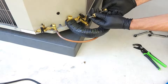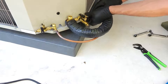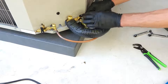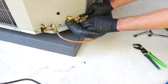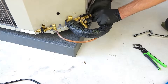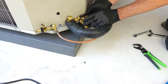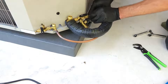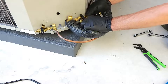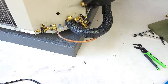The next thing we're going to want to do is put the valve cores back in. You just set this in there, then you open this up. Once you turn that valve, you want to let a little bit of air out of here — you don't want to press any air into the system. Then you press your thumb inwards and turn it in clockwise until it gets hard to turn. Then we're going to turn this to the off position and take this off. We will be leak checking the end cap right here. Let's go ahead and put our other valve core in that side.